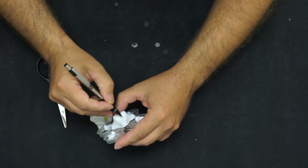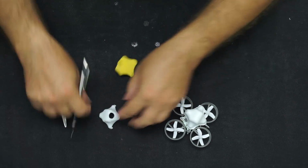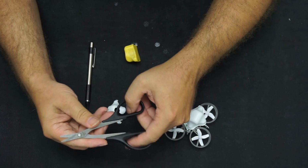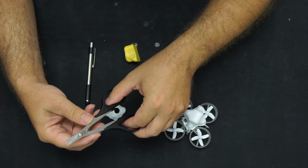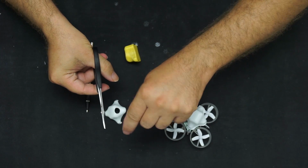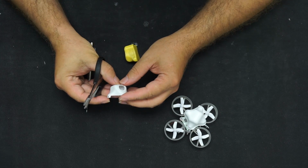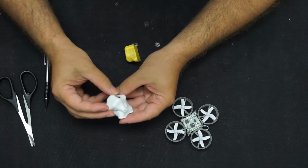And then just cut the center onto that. Now, in order to cut the real crazy angles without damaging it, always use a pair of these body cutting scissors designed for RC car bodies. They're like medical grade, real thin up here, with a lot of control, and they've even got some that have a curve on it, which are really fantastic for getting in here and working around onto the cut line. But you get the idea of what you're able to do here with the vacuum form.